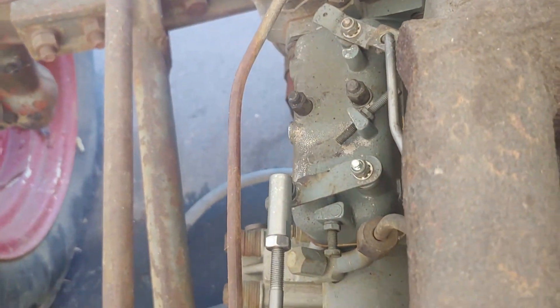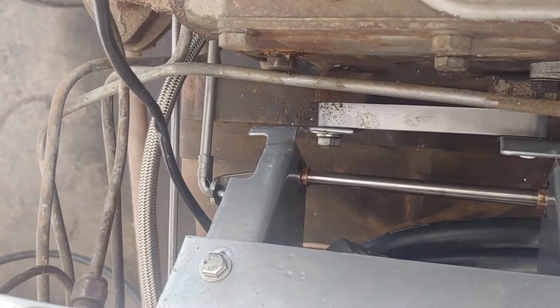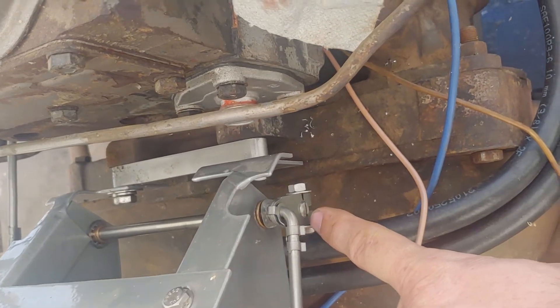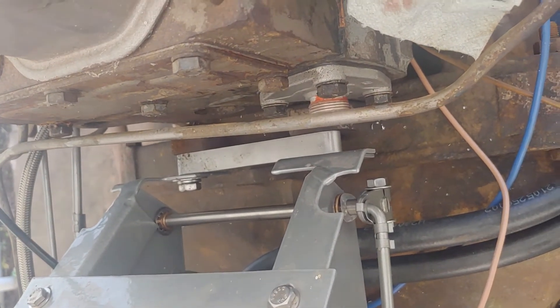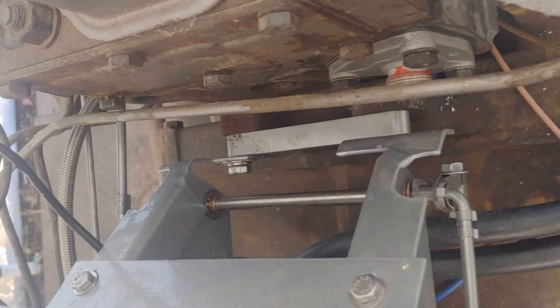Coming back over to the injection pump, it goes from stop to stop. It took a little bit of adjustment once I got the new rods in, but I finally got it. This original shaft that goes across here was just worn out and the holes were wallowed out, so you lost a lot of movement in the throttle linkage. That's what I got these bushings from McMaster-Carr for.